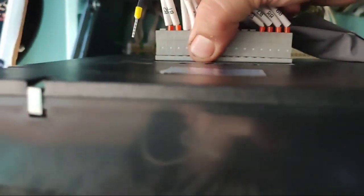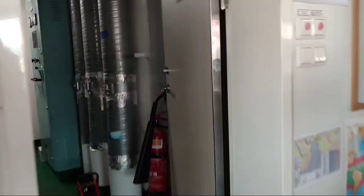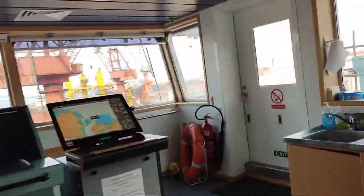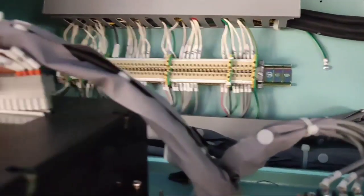Sometimes on other ships I have experienced this wind indicator having a ground fault. Check again. The reading is the same, which means the wind indicator is cleared from ground fault — it is okay. Then connect again.